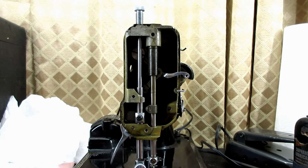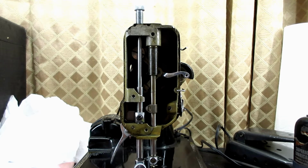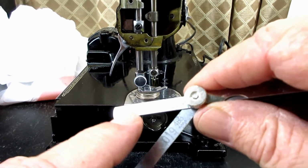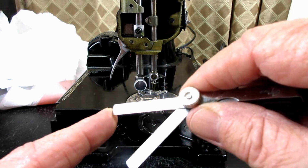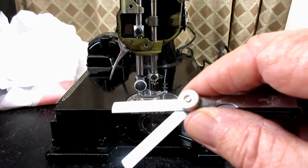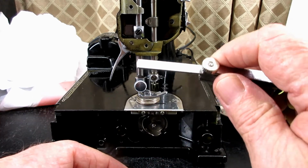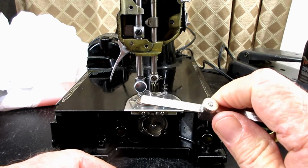So at 7 millimeters, to get my 7.9375, I use two of these feeler gauges in combination, and they're, see, I don't know if that'll show in the light, 0.018 inch and 0.019 inch, which is 0.45 millimeter and 0.48 millimeter. So that combination actually will give me very close to a 0.94, and the goal is 0.9375. So that's about the closest that I can come.